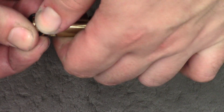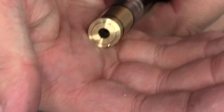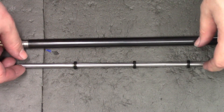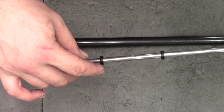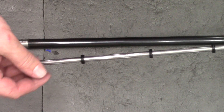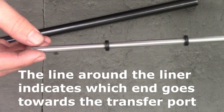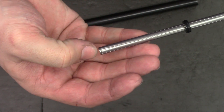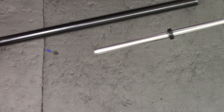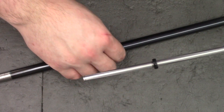And finally we can put the O-ring back on. It's already got a breech seal in it, so we're all good there. Next it's time for the liner to go back in. If you've got a standard liner you probably have O-rings around it, so just put a small amount of grease around the O-rings so they go in nice and smoothly. I also put a small amount of silicone grease on the very end of the liner because there is an O-ring in the steel joiner part, so it's always good to have a little lubrication.